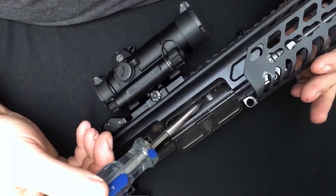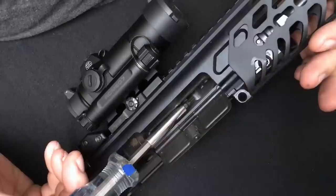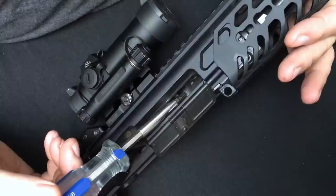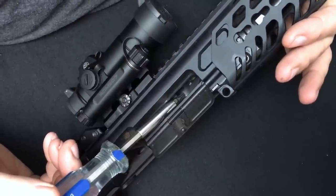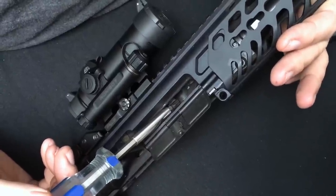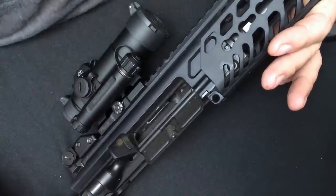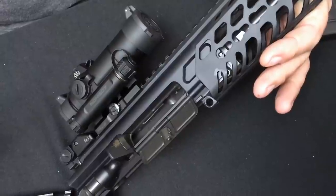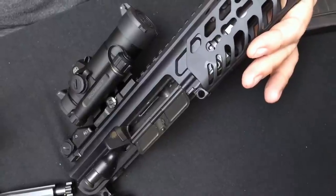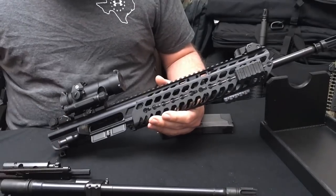That metal insert is sort of similar to what Colt did and what Winchester did in 1968. What that does is it provides a block to prevent the cam pin from damaging the inside of the upper receiver, which is indicative of having an external piston type mechanism on a receiver of this sort, and it's not really dedicated to that particular cartridge. So Sig has put those in both their MPX and their MCX. It's definitely an enhancement for protecting the inside of the receiver from damage. Is it necessary? No, because generally that'll stop. But is it an enhancement over the original design? Oh, absolutely.